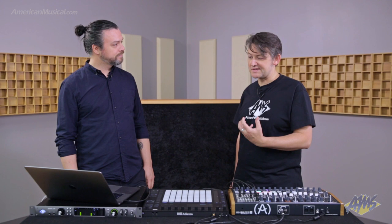We were talking about there are some things you need in order to make this work functionally — it's not like you can use just any audio interface. Well, CV is literally direct current. So what you need is an audio interface that's capable of sending DC voltage out the outputs and reading it in the inputs. Not every interface can do that.